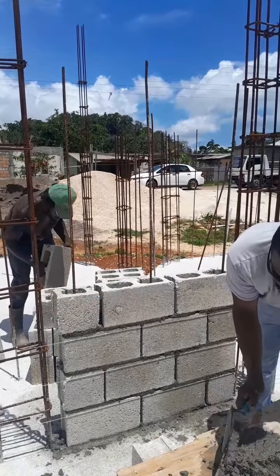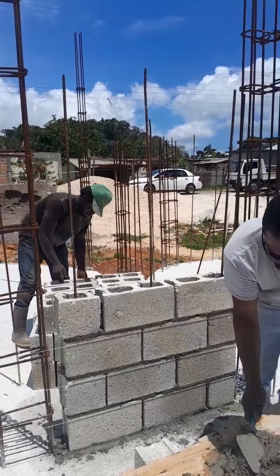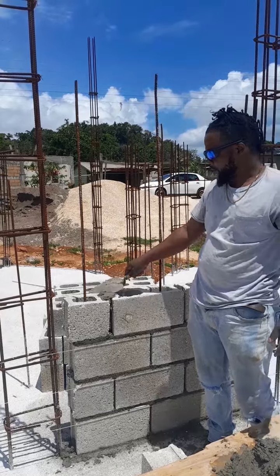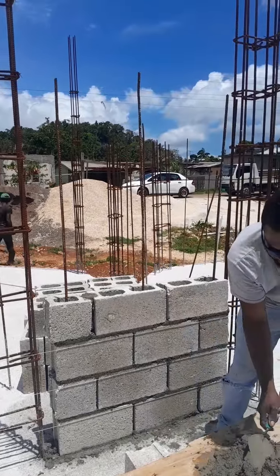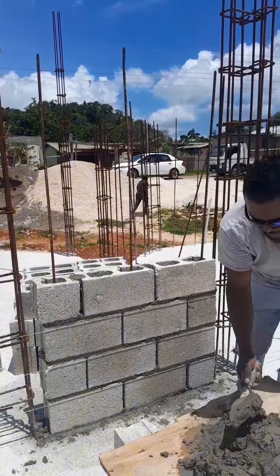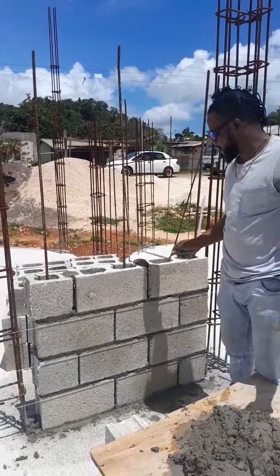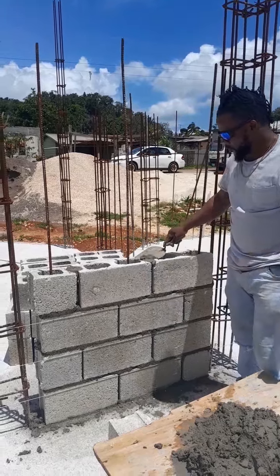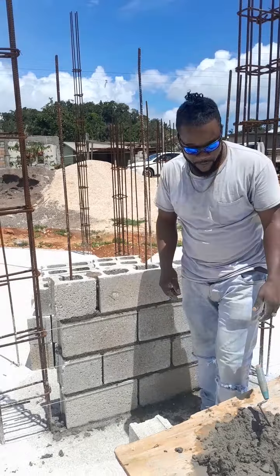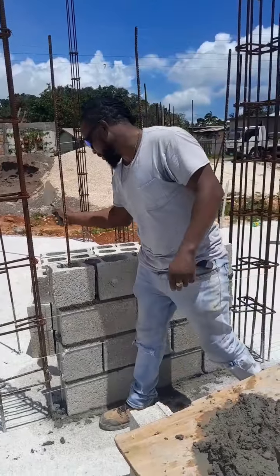And then now, you place the mortar in the middle of the block, between the blocks. We call them the block joint. It's a spacing. Just a half inch spacing. Because we don't run our horizontal bar as yet on our full block pockets, we leave the wall right here until that process is accurate.